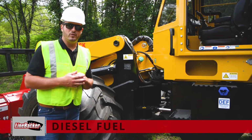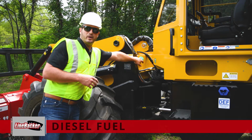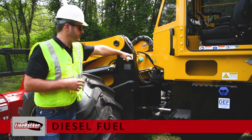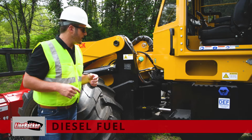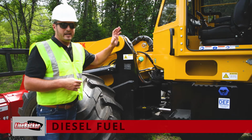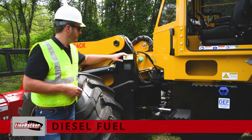To put diesel fuel in the piece of equipment, we have this cap located just right at the chassis pivot area of the machine. Again, you don't want the machine running when you're fueling it, and you certainly don't want anybody in that cab or around that wheel in this pinch point area when you are filling it up.